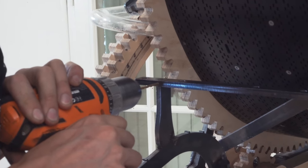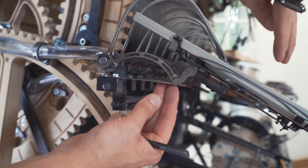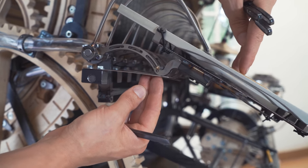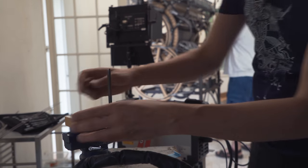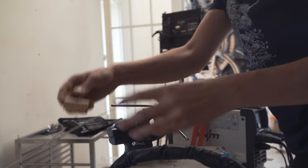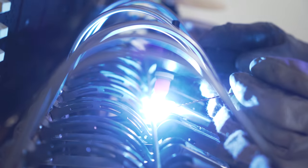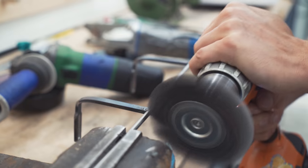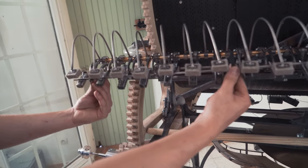I'm working on the positive stop - this is the bar that goes into the vibraphone. These moving plates will go up against this bar and make sure that all of the vibraphone plates are at the same height. Yesterday I made these slots. Now I need to bend this piece, making the bends repeatable by putting it at the same height always and bending it down to the screwdriver with some spring back. Someone just sent an email suggesting we put in the positive stop - we already thought about it actually, but it's fun that the viewers thought of the same idea.